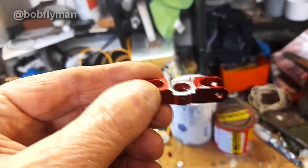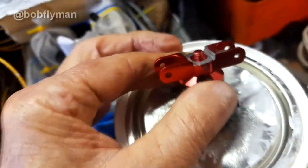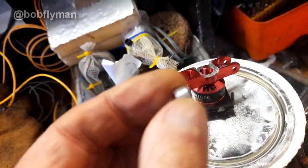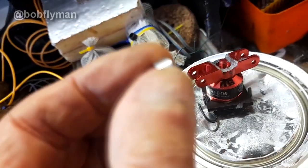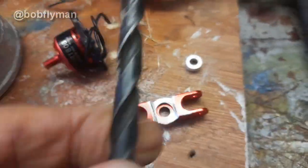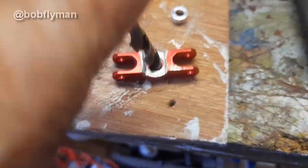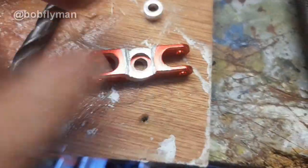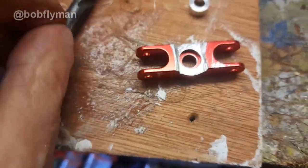That's looking a bit tidier and there's plenty of thread there now to get that prop nut on. All I've got to do now is shim down that a bit so it's not sticking out too much. That's the little bush that actually turns the 6mm hole into 5mm, or probably even easier - drill out that last bit to 6mm so that the bush will go all the way down. Just got to find myself a 6mm drill.